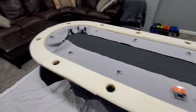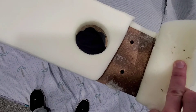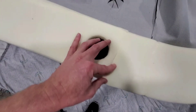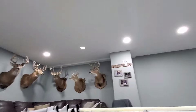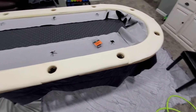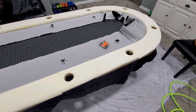I have the rail back on and the rail cover. Where I had to peel back some of the padding, I just put some short coarse drywall screws through the top — only did that in a couple of spots. You want to use coarse screws with this particle board material. In the other spots, I came through and put a screw or two in from underneath just to hold that rail on, because before it was nailed through the top with those little finish nails and that just didn't work out too well. Now I'm going to flip this cover back over and see how it matches up.